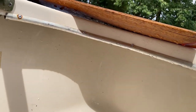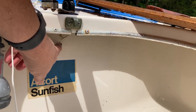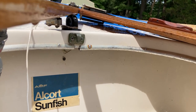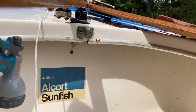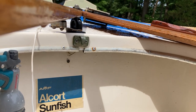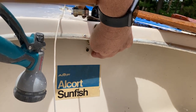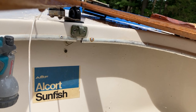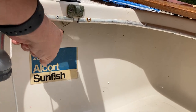On this one there's a hole right here that is a vent hole for the hull — it lets air go in and out as temperature and air density changes inside the hull. You don't want hot moist air inside expanding the hull and popping it. If you see this on your boat: one, don't seal it up, and two, don't store it over winter and let water fill all the way up to that hole — it'll go inside the hull.